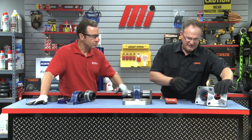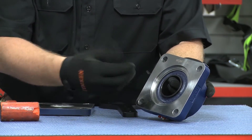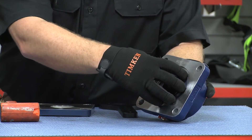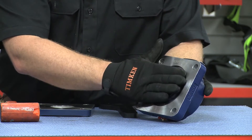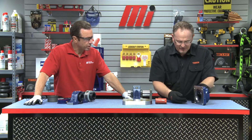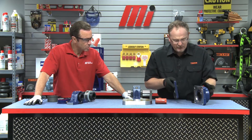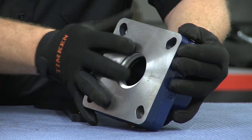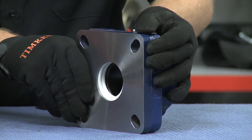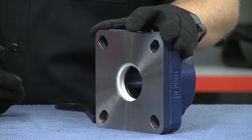Additionally, our flanges have a sealing solution as well. A common industry problem is sealing the back end of a flange due to the cavity in the back of the flange — contamination develops in that cavity, builds up, and works its way into the bearing. We can seal this one of two ways. We have a urethane plate that mounts right into that cavity, allowing the bearing to mount flush into the application. And if we have room — typically we do in screw conveyor applications and others — we can put an auxiliary steel plate machined to fit the bearing and completely seal that off with a double Teflon seal on the ID.